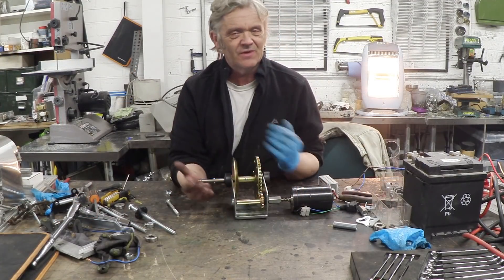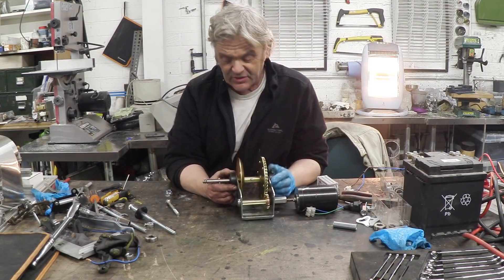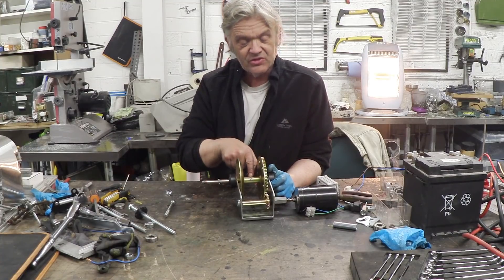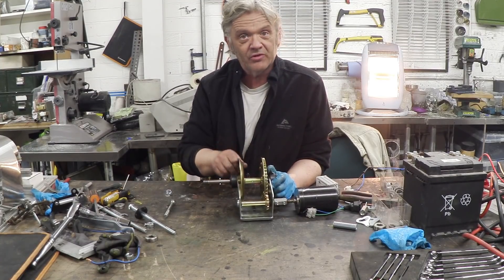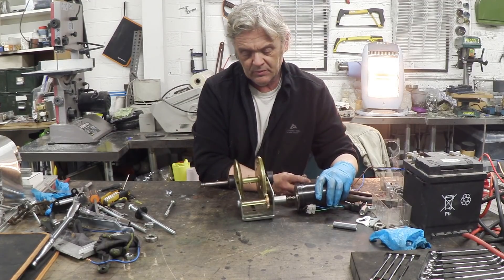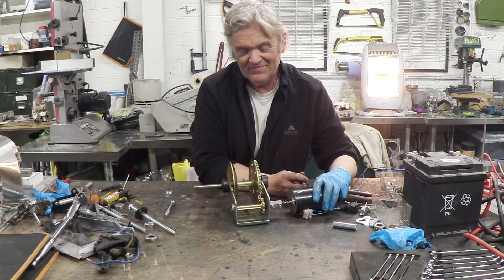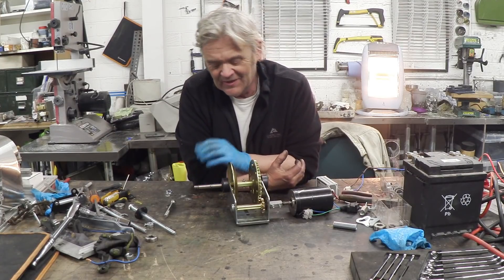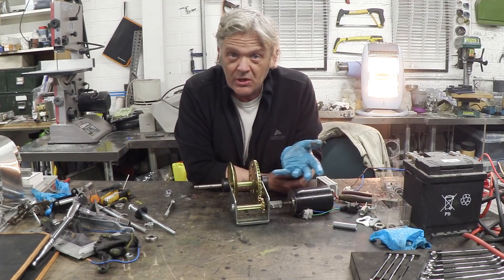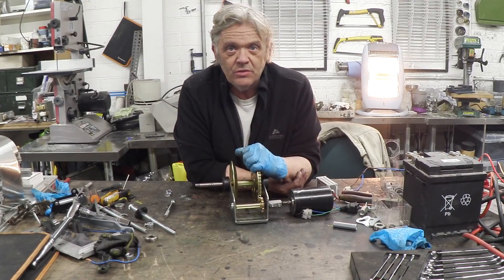So there it is finished. It's really simple — all I've done is put a couple of bearings on there in bearing cups, bolted the original bracket, replaced the bolt that was in the center with a 12mm bit of bar, drilled through the center of this and stuck a 4mm bolt in there as a pin. So if I turn that motor on now, you'll notice it's very much quieter. And that's really cool to see the bearings. Now I didn't replace these bearings, they're still the nylon bushings, but I could replace them if I want. And that is a really cheap gear set.